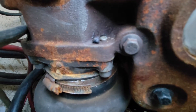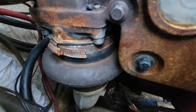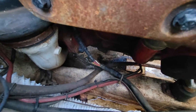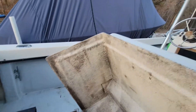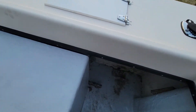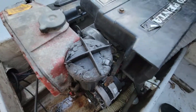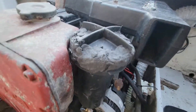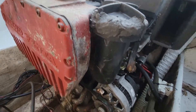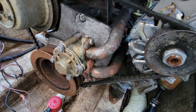The exhaust is rusty here because I never painted it, but this is just surface rust. It was in pretty rough shape as far as how it looked, but it's cleaned up nicely. This part here is a bracket — a flange that goes from the exhaust to the outlet pipe — and that was cracked. I had to braze it because I could not locate a new one. One part that needed to be jury-rigged was the cap for the raw water inlet strainer — I couldn't get a new one and it cracked, so it's got a fair amount of JB Weld on it.